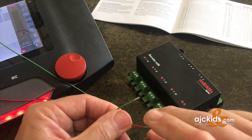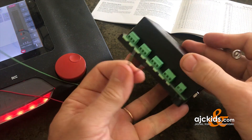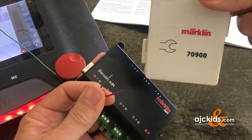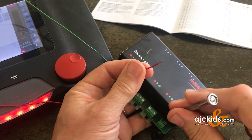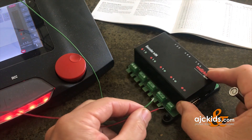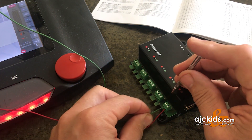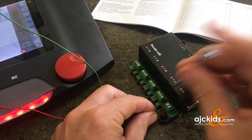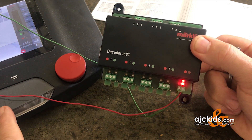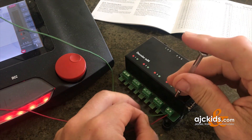I'm going to start off by making a mistake on purpose — I'm going to switch the two wires so you can see what happens. They don't want you to solder these; just twist the ends for a better contact in the screw-type connectors. The screwdriver from our little 7900 toolset is perfect for these connections. I'll put the red one in the brown port and the brown wire in the red port, then turn the power on. You can see the decoder is not happy — fast blinking between the two lights and a little noise. Power is back off.